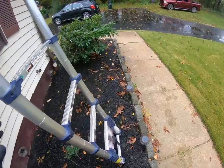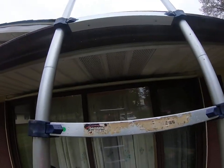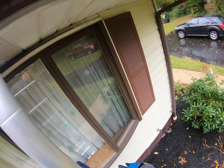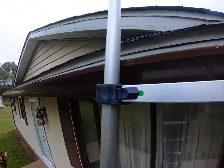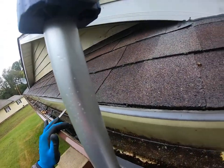The reason that's happening is every time it rains, like it is today, that water is backfilling out of the back of the gutter — you can see all the drips here — and it's going down and hitting that foundation. The reason why that's happening is, coming up here, you'll see all that standing water sitting in your gutter.